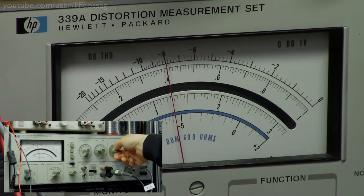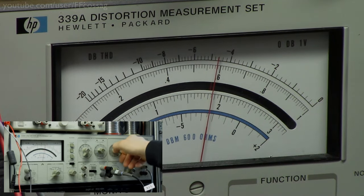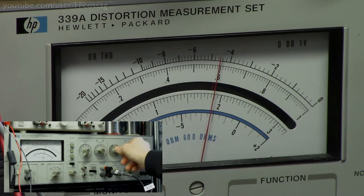Righto, so this is not very good performance for a so-called subwoofer output. -3 dB point at something like 30 Hz, and that's just not very usable at all. But I suppose for your generic, cheap, so-called subwoofer that doesn't have a frequency response below 30 Hz, it doesn't matter, but yeah, for any kind of more real stereo or a car stereo or something, this is not going to be very good. Not impossible to modify the board in order to make it better, but yeah, output-wise, that's pretty poor.